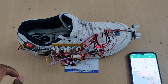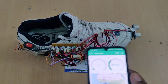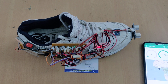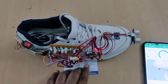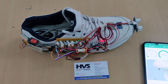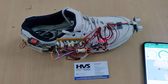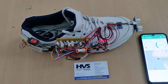When this project is demonstrated outdoors with a clear sky view, the GPS will receive live location data from satellites. Currently, it shows zero-zero values because GPS does not work indoors due to no satellite visibility. GPS works on the trilateration method — when signals from at least three satellites are received, it provides PVT (Position, Velocity, Time) data. The position coordinates are then used to map a point on Google Maps within the Blynk app.